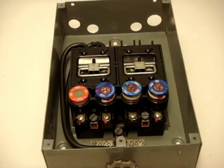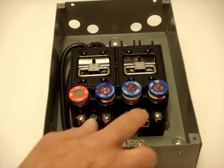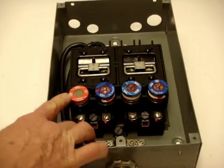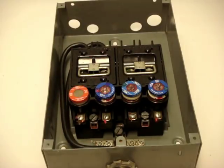A service of this vintage would typically have three 15-amp fuses and one 20-amp fuse. The 20-amp fuse generally supplied the kitchen receptacles, dining room or dinette, and laundry if there was one. The other 15-amp fuses went to furnaces, sump pumps, lighting, and outlets throughout the rest of the dwelling.